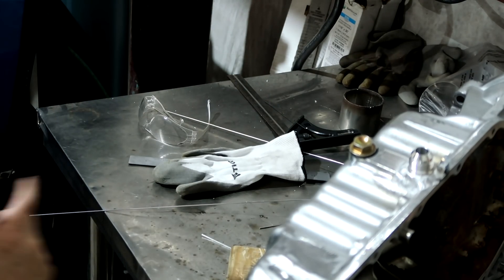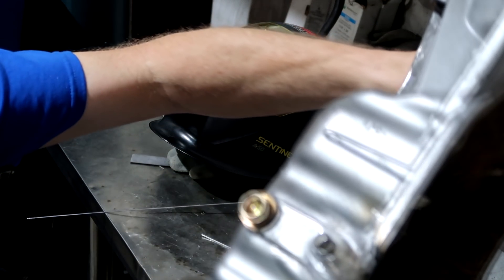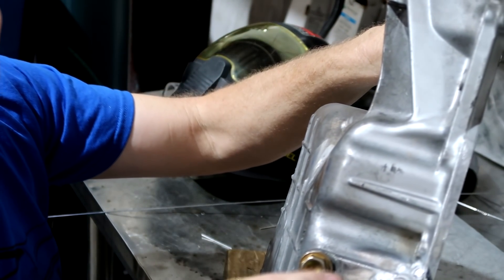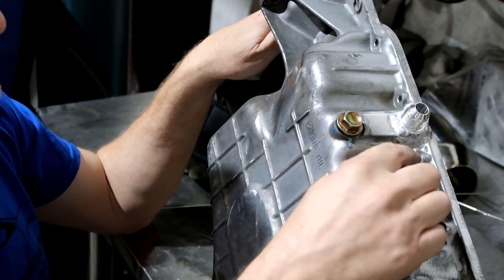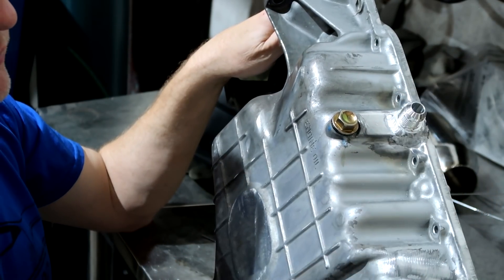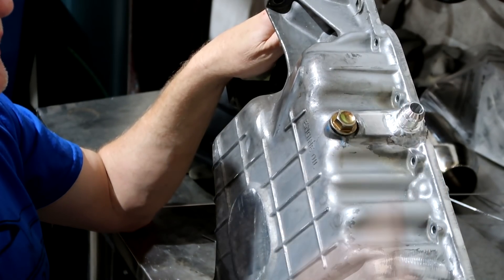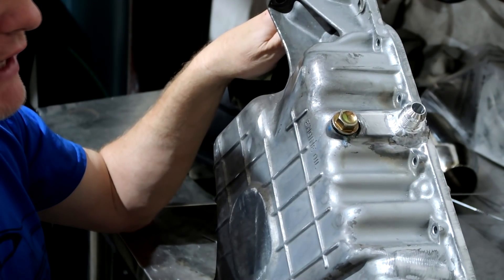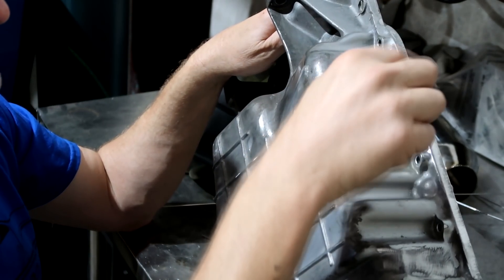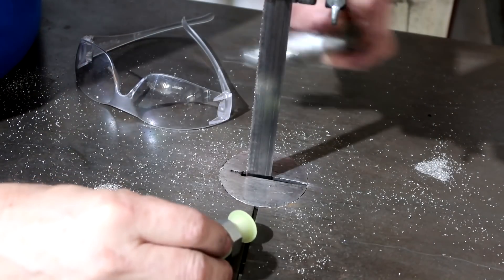There we go - good, let that cool. See that? We've got a nice attached piece now. Got to be extra careful with this part right here - this is the taper. This shape right here is the exact match to the other part that goes on. Don't damage that. Once you're done with your pad, once it cools, put a rubber sleeve on it, put a cap. Like these steel ones - they come with a cap. Put it on there to protect it. If you damage that surface even a small scratch, that is like a valve and a seat - if they don't fit properly it'll leak. I see it so many times: people put the stuff together and it gets scratched and then it's no good. You're going to cut the fitting off and redo it. So be careful of that.